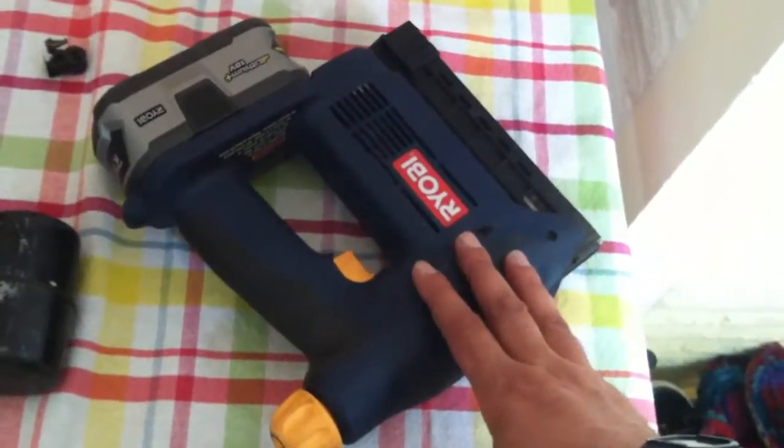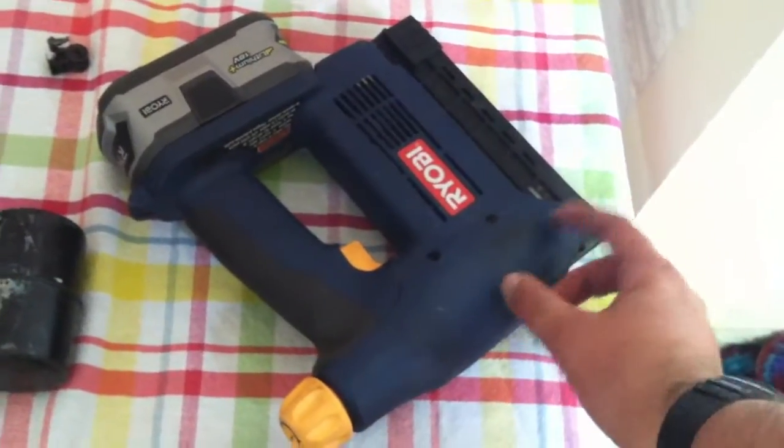So I carefully put these in. They kind of unfold into the two slots. I draw it up on the bottom because these factory cuts are very square. And then I staple it in. One of the things, if you've previously been doing a little roofing work or something using wider or thick, longer staples, you want to switch to the thinner, smaller staples on this, just so they don't shoot through. I remembered that before getting on this, so there was no problem.